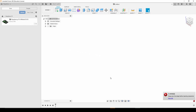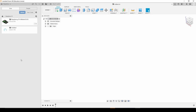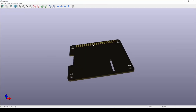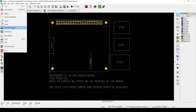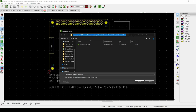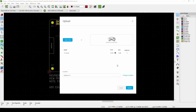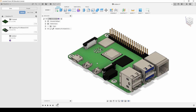Copy the downloaded file to wherever you want to save it, then go to Fusion 360 and upload it. You can drag it in, click the upload button, and give it some time. Once it's done you'll see it's uploaded. You may need to save it first — Fusion 360 stores everything online as cloud storage. Then for the PCB, we go File > Export > STEP file in KiCad, then upload that to Fusion 360 the same way.